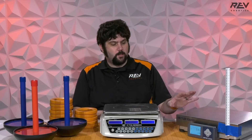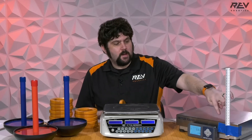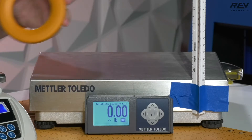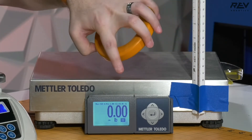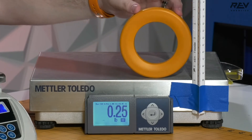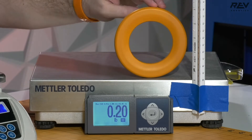The second step — what I have over here is one of our other shipping scales. What I did is put an engineering ruler on and zeroed two inches to the top surface, which means these rings will be about at seven inches to start. So we're going to push down on the ring and take a look at the force. The ring is about at seven inches because it's five inches, two inches off the surface.